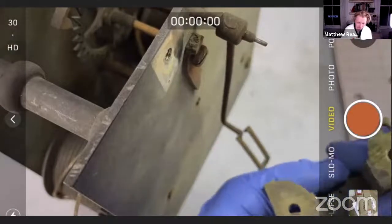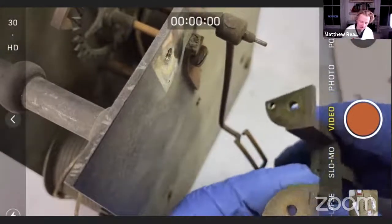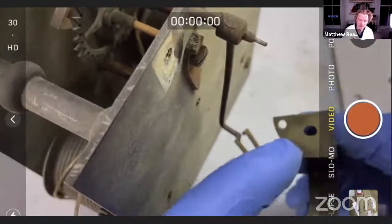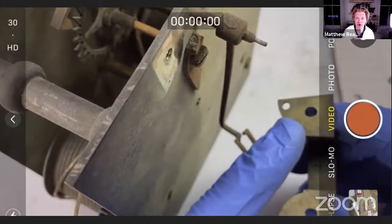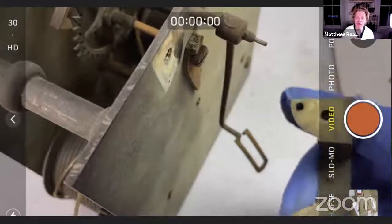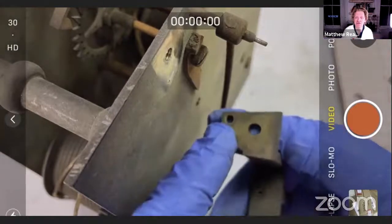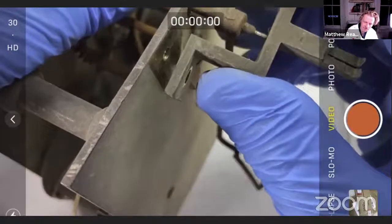There's our back cock. No steady pins. So that, I think we mentioned it before, makes our life a little bit easier when it comes to adjusting drop. This hole here is sometimes just cut away underneath the back cock foot. You've got to be careful not to miss that bearing, because it isn't often like this where you can see right through it. You've got to not miss it when you're oiling because it's hidden underneath the back cock and it's easy to miss.